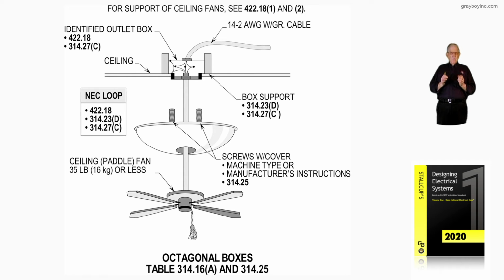And many times, if you had, say, a 2-story house, you could take the ceiling box, cut a little hole, and it's designed so you could push it up in there and hammer it in, and both sides hammered into the studs, the framing members, and then the box can support your fixture without you having to do a lot of additional work because it's a 2-story and you're on the bottom floor.